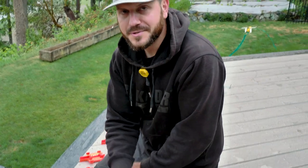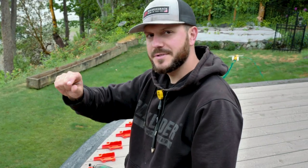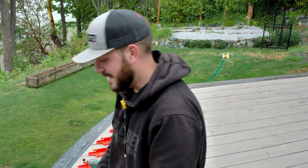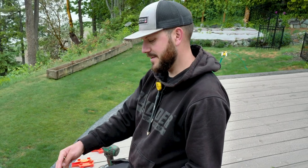What I'm doing here — if you remember from last week, we clipped these boards with that Fasten Master five-shot and then we left the ends kind of loose, putting a thin piece of wood under them to lift the ends of the boards up about a quarter of an inch. That way Jason can cut the curve out without cutting our bladder out, which causes leaks. Now I'm taking our Fasten Master Cortex screws and pinning the ends about an inch away from the end of each board. With the clips and the Cortex, that ensures our boards aren't going to slide in and out — sometimes a concern with clips. Once you Cortex the ends, there is no expansion or contraction. That's what we like to do.